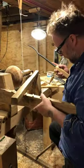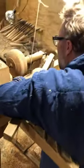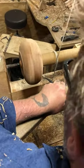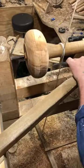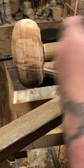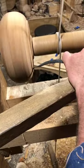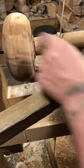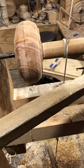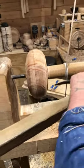Adjusting the tool rest really matters because you can get a better pivot point closer — it brings the tool up and allows you to cut in straighter versus on an angle. I'm going to actually step off my lathe and use my right foot on the pedal just for that 90-degree cut, then back to turning. I went in extra deep, and now I'm going to turn the top surface down a little bit — just gives me a little more room. You might need a couple of attempts, so give yourself extra.